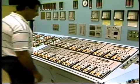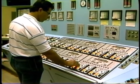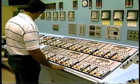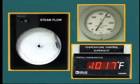Let's now examine the requirements for on-load operation of the boiler and some of the difficulties which may be encountered. The prime task of the boiler operator is to assure that the boiler follows changes in steam demand from the turbine generator and maintains the rated steam pressure and temperature.